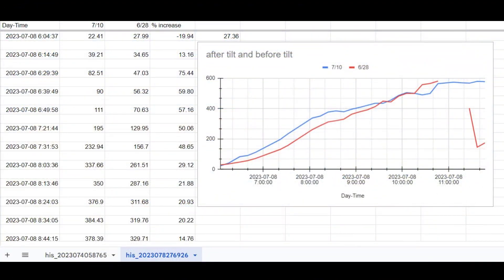As far as the gains you can expect: I have an Epever charge controller which has a cloud function that tracks all of my previous three months of data. Looking at what it looks like with the panels up versus panels down, I picked up about a 27.3 percent increase from the morning hours to about noon. And that will be added to by the other side of the shed also being lifted, giving me another estimated 20 to 30 percent morning sun.